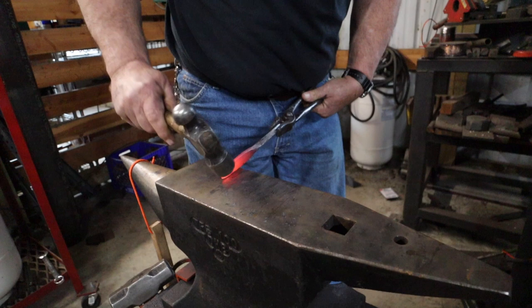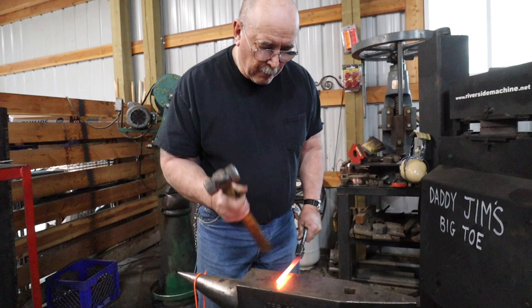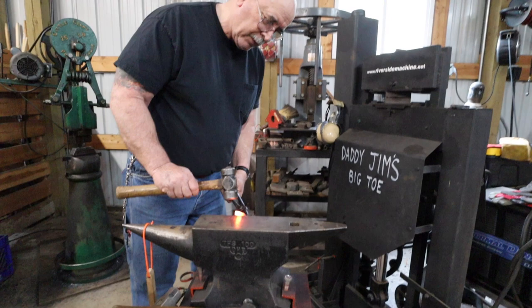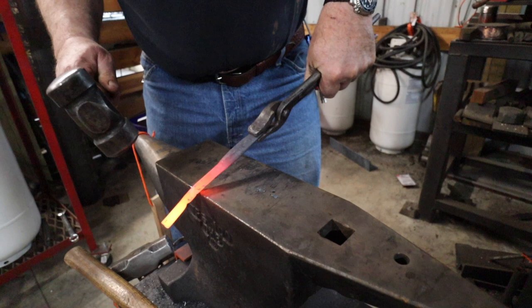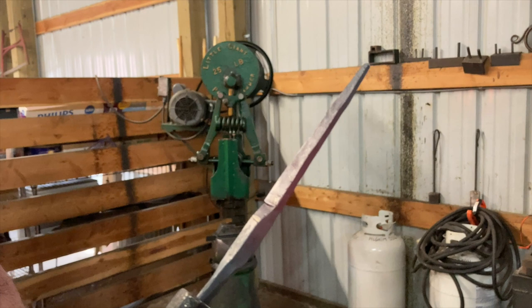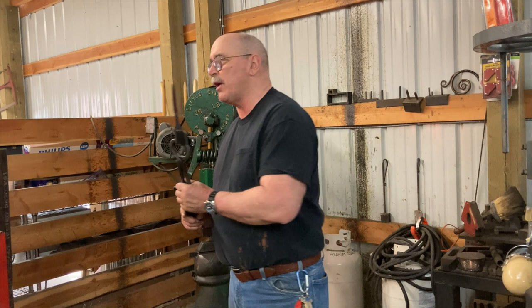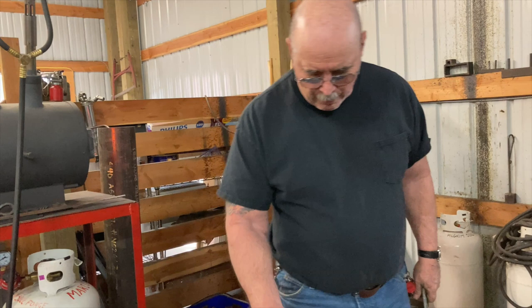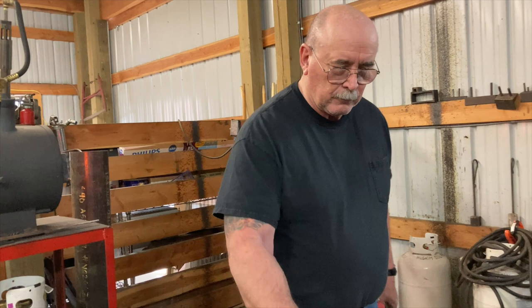I want symmetry. I'm going to mark off a section to put the twist and the curl. I'm using what's called a half-face blow to put a shoulder in there. We've got a nice deep shoulder in there — that's a fairly well-polished piece of metal. Not only do you have to control the shape of the metal, but where a lot of blacksmiths drop the ball is they're not maintaining surface quality. That was the hallmark of the old European smiths: not disfiguring their materials.